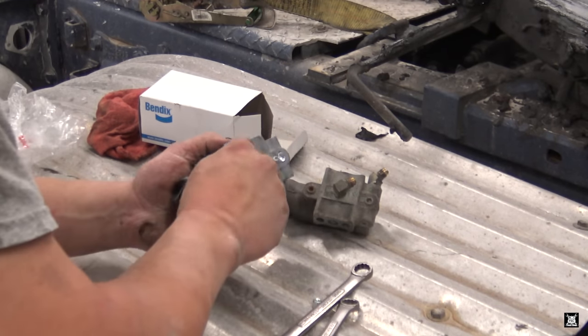Alrighty, boys and girls, here you go. Here's your air dryer. It sits up like this. This is the part when you're driving down the road and the tanks are full. That's the part that goes psh, right out of here. That plug right there is a heater. It gets cold, that heats up so the water don't freeze. If it does, you'll blow your line that feeds this thing. So gotta be careful, don't do that. It's in, unloader, out.